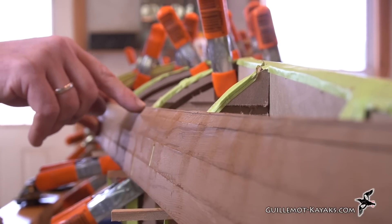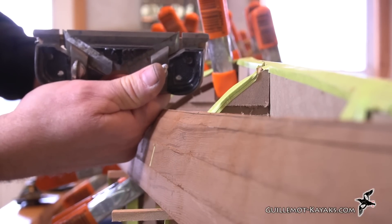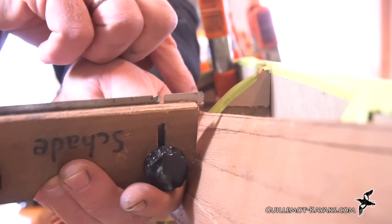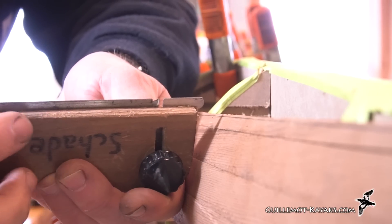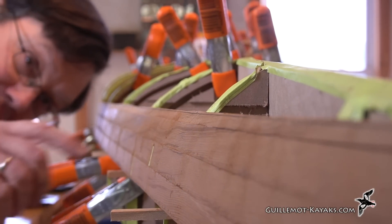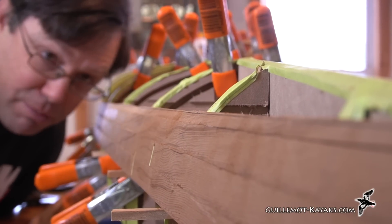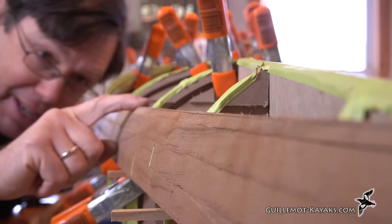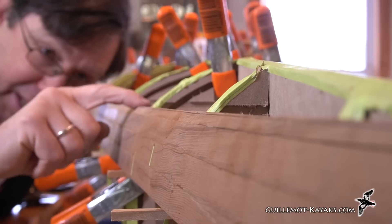What we're going to do now is just eyeball down it and make sure everything looks straight. If it looks straight, it is straight. The tool I use is one of these side rabbet planes — I can trim right up to the edge because the plane blade comes right to the edge. As I go past the forms, I'm not going to cut into them and the forms aren't going to get in the way. I set this fence up at such a distance that I can trim right past the forms and keep on going. What we're looking for is to trim off the high spots.